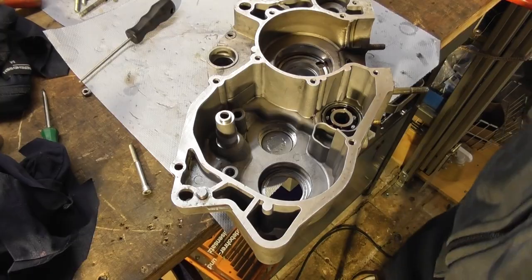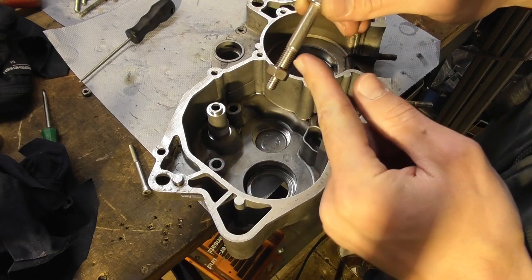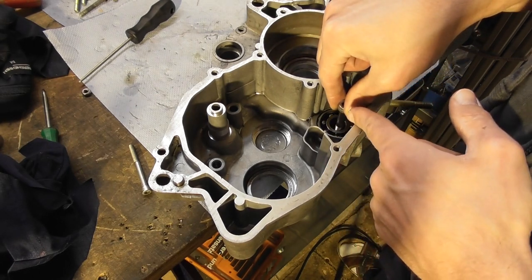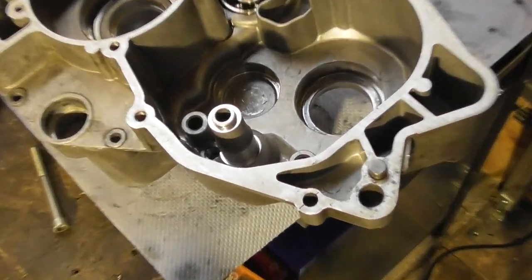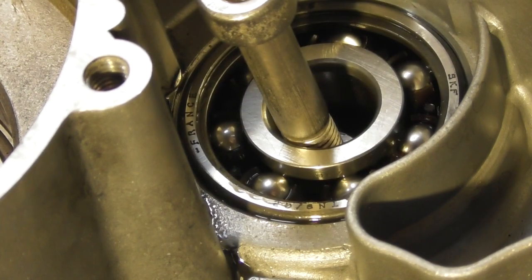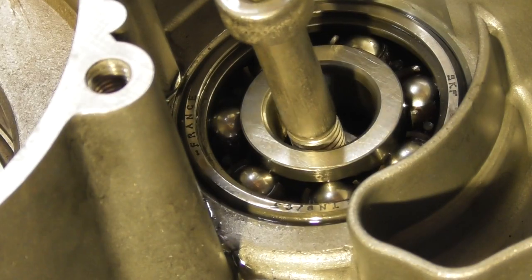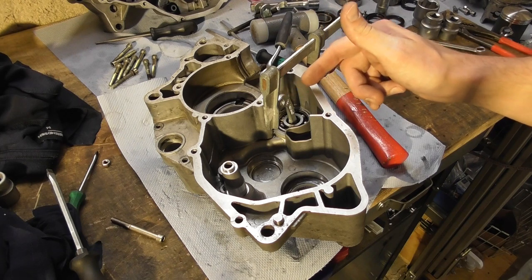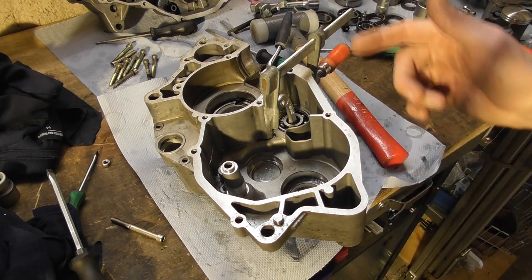Now only one bearing is left. What I'll try is putting a washer inside so I don't destroy the aluminum on the bottom, then use a screw to try to lift the bearing up with the surface of a nut. Put it in, hold the nut, and then turn the screw in — that's the plan. The screw is loose so I think it moved a little bit. The screw method didn't work well, so I'll try the three-arm puller method again, putting three nuts in the hole as a support for the arm. I'll try with heat and cold spray.